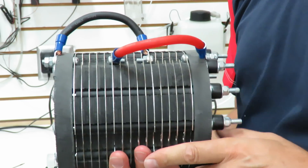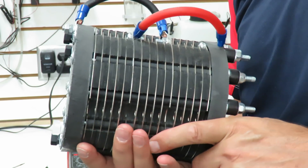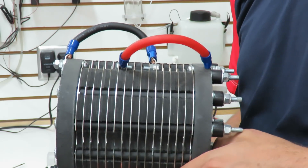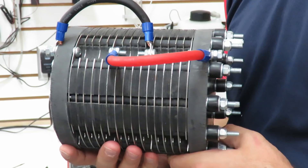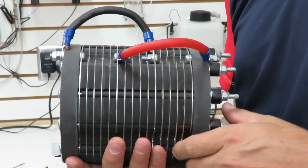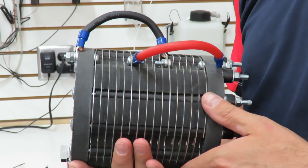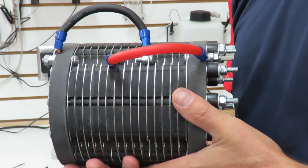You had to use a system that would keep the gases separated. When the gases are separated and the pressures are the same on both sides, this cell works great. We were able to get 99.98% pure out of this generator, running it through a purifier. But trying to make our compression system — the complexity of it made it really hard to do. For everyday users, really hard to do safely. I didn't make any more videos about compression because I was really concerned with being safe.